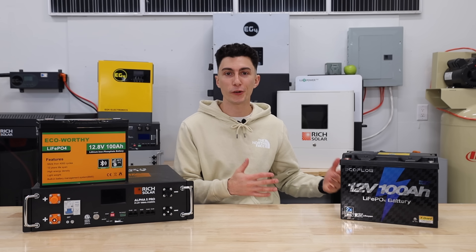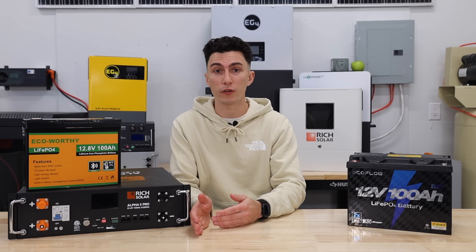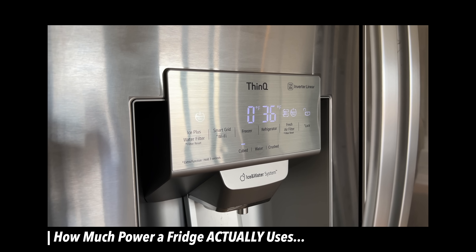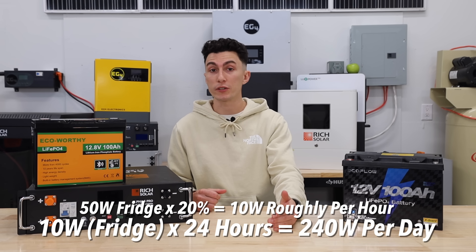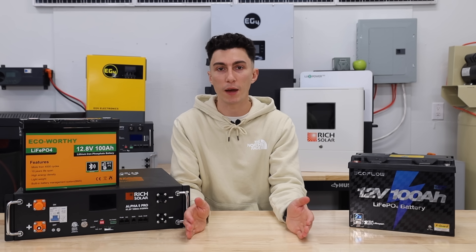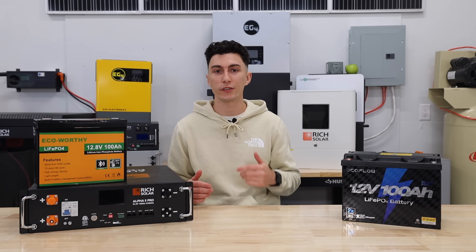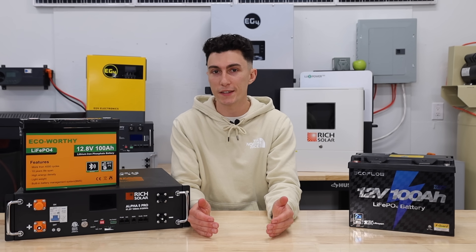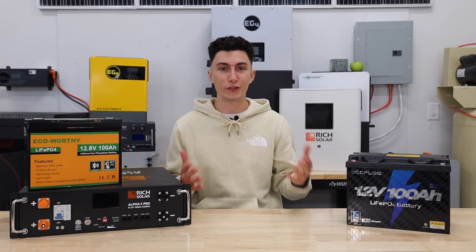Make sure that you have enough. In the middle of winter, his guests use roughly 10 hours of lights. The UV bulb for water treatment is on 24 hours — there's no way around it. The fridge is also on 24 hours, although fridges don't run their rated output all the time — they run about 15 to 20% of their rated output per hour. We're going to go with the high-end number and say it uses 20% of its rated power every hour, roughly three hours on the TV. Add it all up and get a number for how much power is used every 24-hour period. We'll leave a link to a calculator in the description. We recommend rounding up on any numbers and giving yourself a little bit of extra leeway. If you're doing this for your entire house, just go get your electricity bill — most bills show your daily, weekly, and monthly usage.